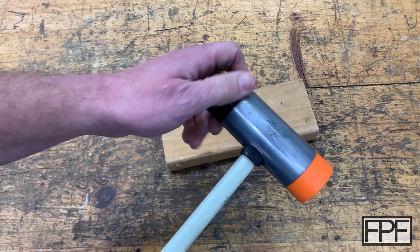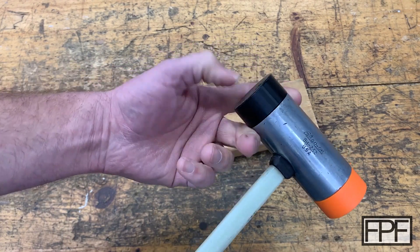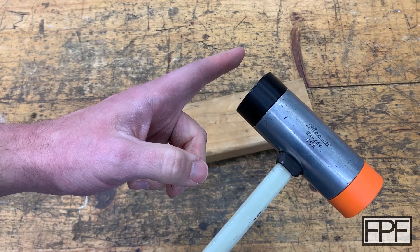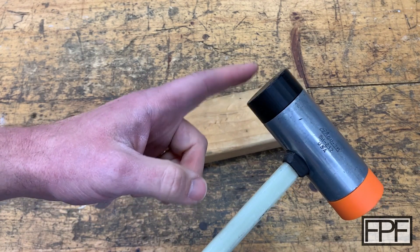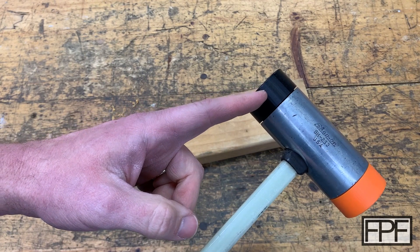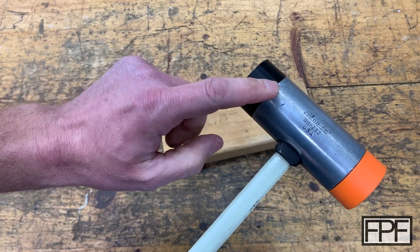I can certainly vary the material I was using to print these, and I can vary the amount of infill as well. I did a pretty dense infill on the PLA — I think 70% — and I did 2 millimeters of solid layers first just to make sure that if I was hitting something smaller, this guy wasn't going to break through to that infill. This side I did pretty soft, and honestly I think I could go softer. I did 10 solid layers on the end here, so maybe less solid layers on the face and less infill for the first 10 millimeters, then more infill on that back face where it threads in.